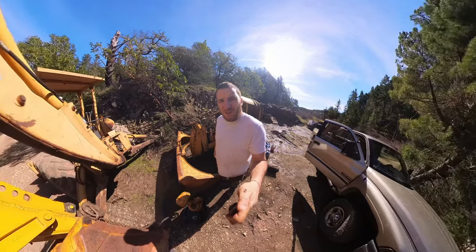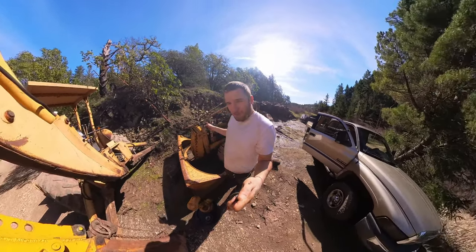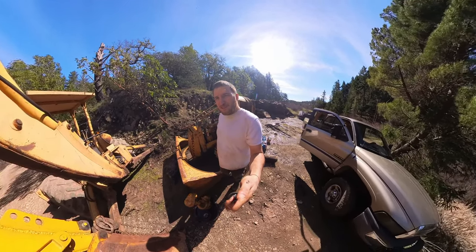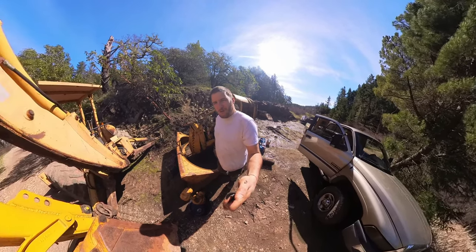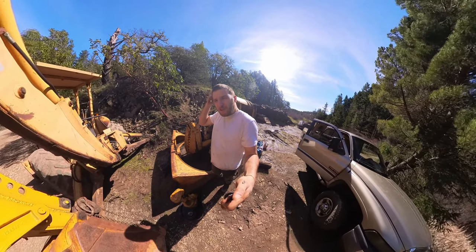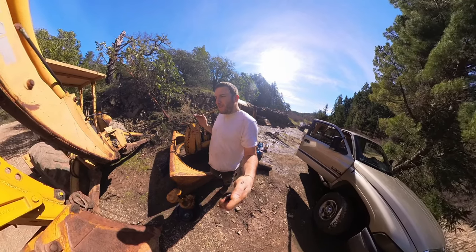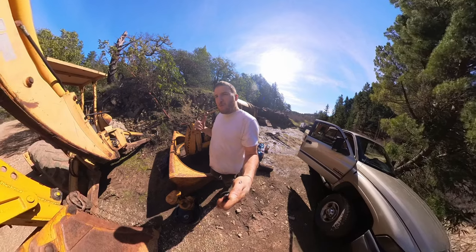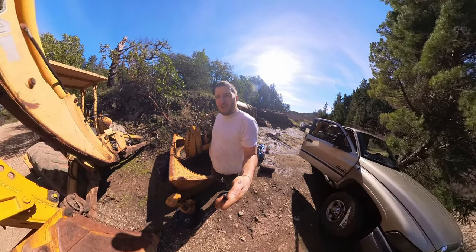like he had some kind of weird oil container that filled up full of water. And he poured it in there when we were trying to start it. So yeah, you're not supposed to put oil in the radiator. So some kind of red oil, like two-stroke oil or something. I don't know. So I got to flush that out before I can start doing the rust flush, I believe. So I'm going to flush out the oil stuff, and then hopefully I'll probably do two flushes down here with just water jugs. And then hopefully that'll be good enough for it to run cool enough to where I can get it up to the house and use the hose and get that flush going on.